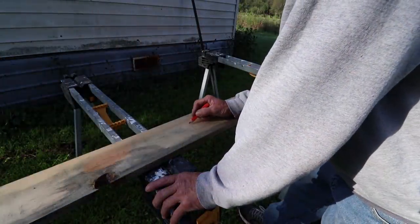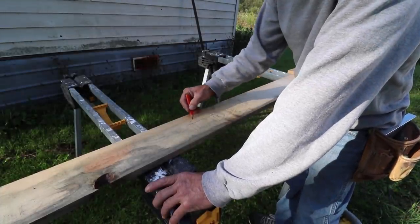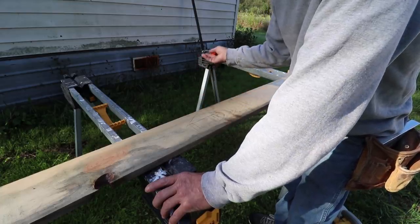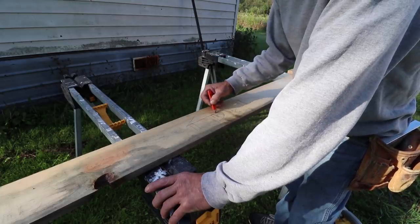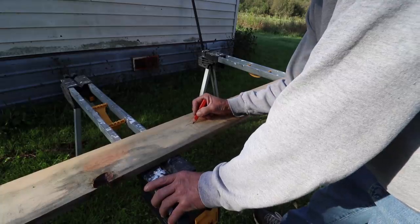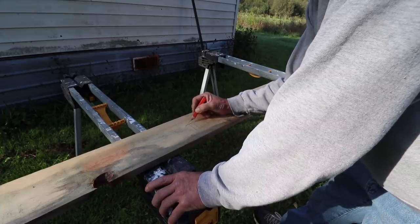Originally, when I thought about doing this, I thought we'd have the walls and then I would just get trusses to go across here. It'd be easier for me. And then of course now you have to wait so long to get them. My biggest problem is I wouldn't have been able to do a flat across truss unless I were to hand make the front door, because now our studs were 71 1/4. That means we're at 72, 74, 75 3/4.